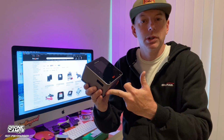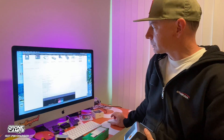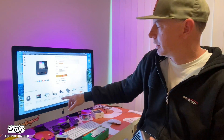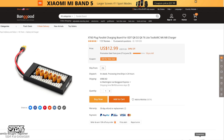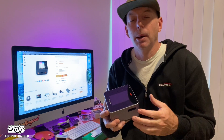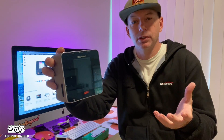You can get a parallel charging board for the front port. You can buy several different versions of that board. On the website, look in the frequently bought section and you'll see all kinds of adapters. You want something with an XT60 plug port. You can get XT30 boards, XT60 boards, or even little PH 2.0 boards that plug right into the XT60 — and then you're ready to charge a bunch of tiny whoop batteries, all the way up to 8S batteries. This charger can handle pretty much anything.